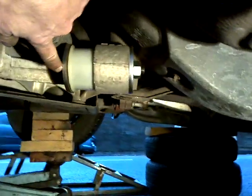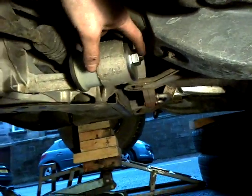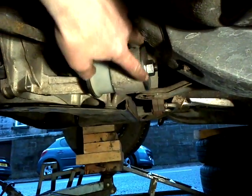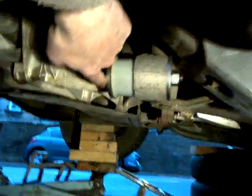Custom tool job. The laser company, Lasermaster, which I use down south, had them make two custom stainless steel washers. Initially, with the bolt length — just in case you get what's available — it's a shaft size of 16mm, so had the holes cut at 17mm to give a wee bit of play, and the outer diameter was set for this.